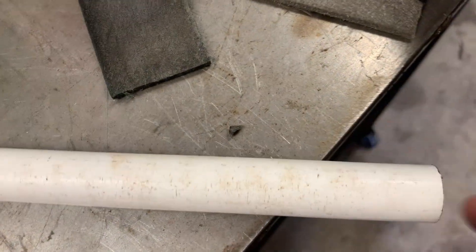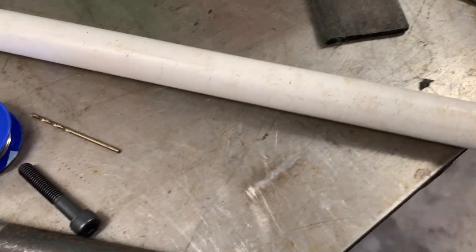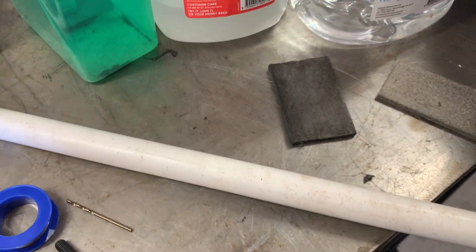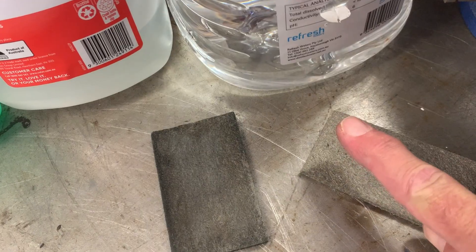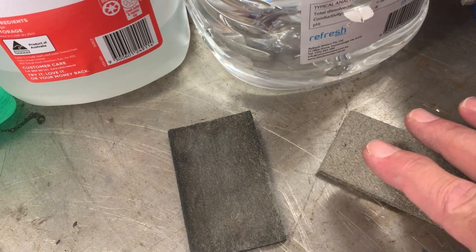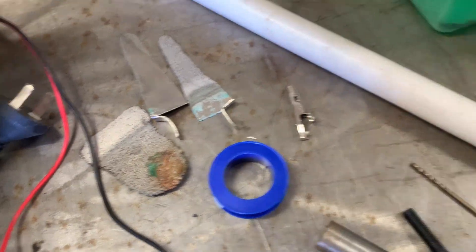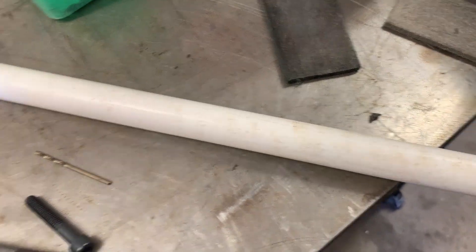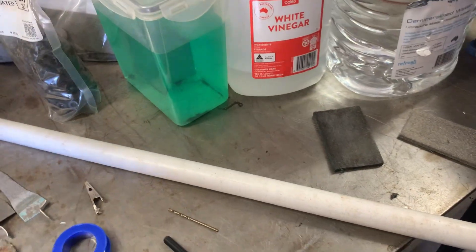I'll test it because I'm going to make a small one to test where I can add various different materials. The main video is just about getting the whole idea of this setup through so people can make their own nickel iron battery. I did discover that four layers of carbon felt stacked up have only about 1.2 ohms resistance. So you could probably do four layers and then one of these little nickel wire coils. A steel tube coated with nickel would probably be best, and then you wouldn't even need the little coil piece. Hopefully that clears everything up for your nickel iron battery making.